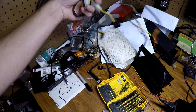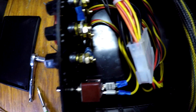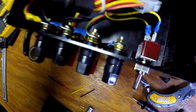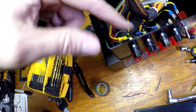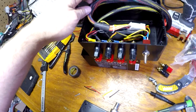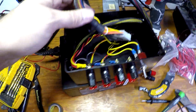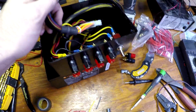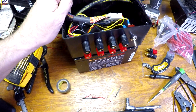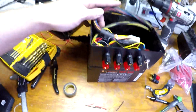Here's the pretty much finished unit. I trimmed off a lot of the unused external connectors. The top row inside is all grounds — daisy chained together using about four or five ground wires from the bundle. I used two to three wires per voltage connection — so if there were four or five wires carrying 5 volts, I picked two or three of them. The switch is hooked up, and there's a sensing wire — usually green — that you just ground to activate the supply. This one doesn't need a load to keep running, which is nice.